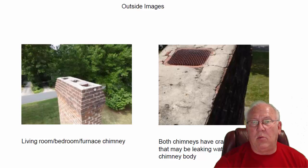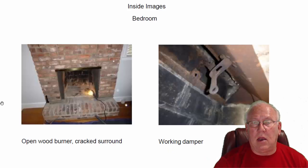What I recommend on both of them is chimney caps, just like your neighbor to your left. If you look from your front door to your left, that's what I would install up there. That'll take care of the cracked crown issue. The screen could be removed. The caps will keep the birds, the squirrels, and the rain out of the chimney.